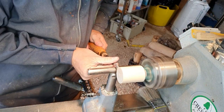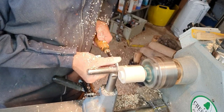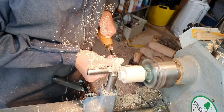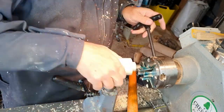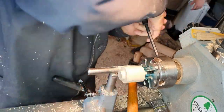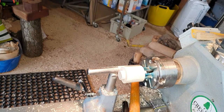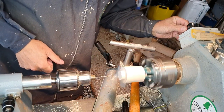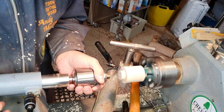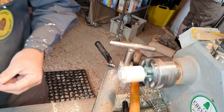This is the top finial that we're turning here. In order to make sure the top and bottom finials connect in between the sea anemone, I drill a hole in one end of the finial and then connect that with a piece of beech dowel about three mil thick. It's just enough to connect them together inside the sea anemone and it means that they hang nice and straight.